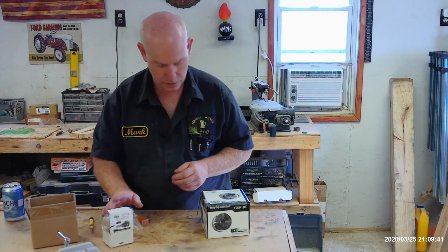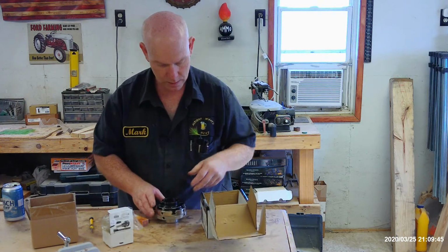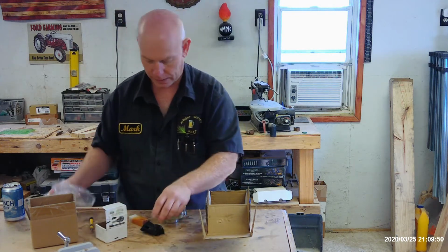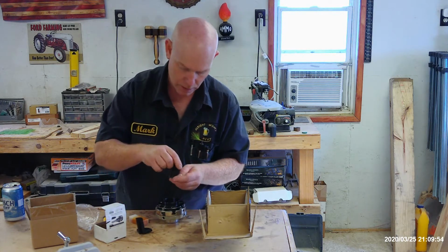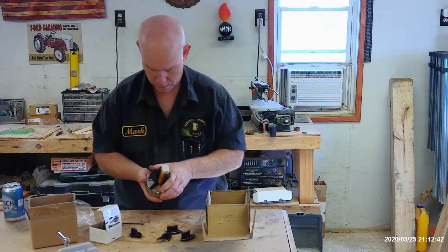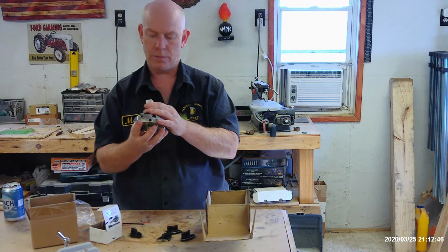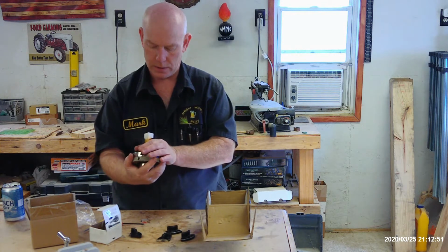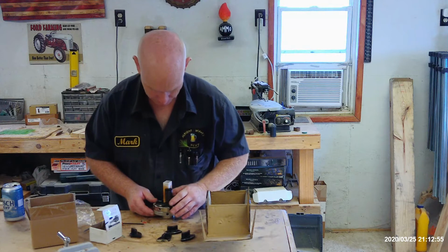But what we've got to do this is my 4-jaw chuck, and I have a set of pin blank jaws for it. Now these jaws are numbered. You've got a number 4 and a number 2, and the jaws on your chuck are also numbered. I don't know if it's going to matter much. I guess it's probably supposed to be a square blank, but this is a rectangular blank. But it looks like it'll lock in there fairly nice, fairly centered.